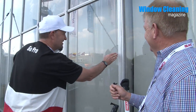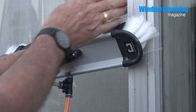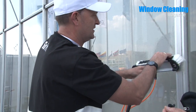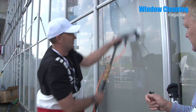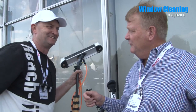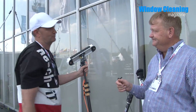Because it's an aluminum extrusion, we can cut the aluminum extrusion to match the frame. We put the short bristles in here — they'll clean the frame. The long bristles here clean the window. So even if there's a framed window, we can do one stroke, two strokes, slow rinse, off. For a dedicated facility that might have 14,000 similarly-sized panels to be cleaned, creating a brush specifically for that is going to create real efficiency. Like this wall here — you could make a custom brush for it and just get on and get off.